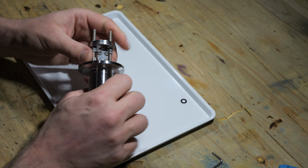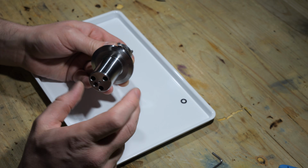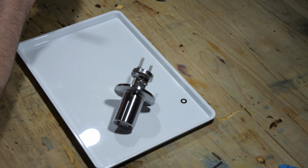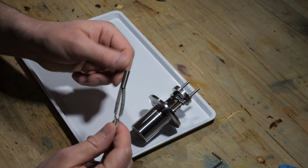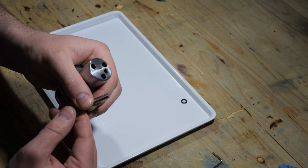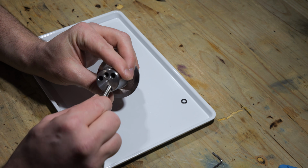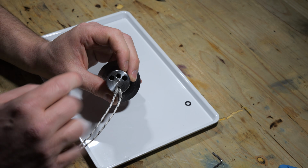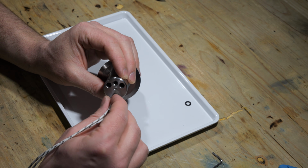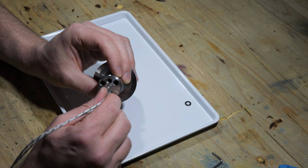I thought about using one of those heating clamps that is used for injection molding machines, DIY injection molding machines. But in the end, I settled with these heating cartridges. They are meant for 3D printers. They are 24 volts, 50 watts, I think. And I have these 6mm holes drilled here in the back, and they fit in there. And I have 3 holes because I have 3 of those heating cartridges. There is a tiny amount of play right here, otherwise I wouldn't be able to push them in.